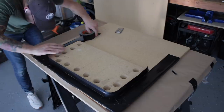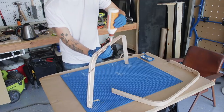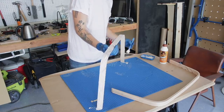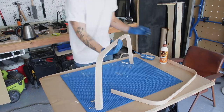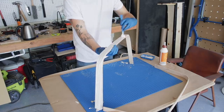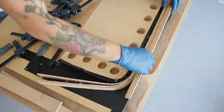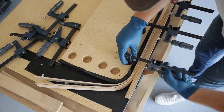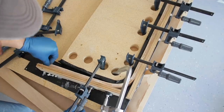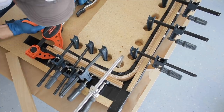My next step is to glue my three layers together. But before I did that, I put a layer of Gorilla Tape down to make sure my pieces don't stick to the form. These silicone glue brushes are one of my favorite products that Rockler makes — I'll leave them linked in the description along with every other tool and jig I use that they sell. This final run of glue-ups could not be less stressful. The boards were already at the right shape and I had 30 minutes of working time with Gorilla Wood Glue, so I just took my time, made sure everything was lined up, and used plenty of clamps to reduce gaps between my boards.